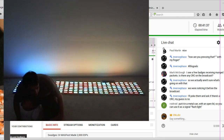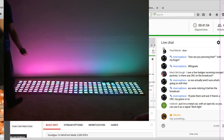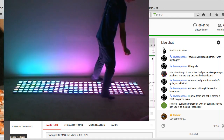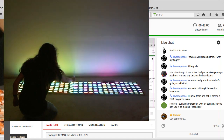Your two questions are: is there CRC on the broadcast or on the receiving end? I'll explain those in a minute. And the other question was, did you wire GPIO9 to reset to do the deep sleep? Oh no, it's GPIO16. We did wire GPIO16 to the reset in order to have it so that they could do deep sleep. Though we didn't know how to do it at the time, we totally did write some deep sleep code later.